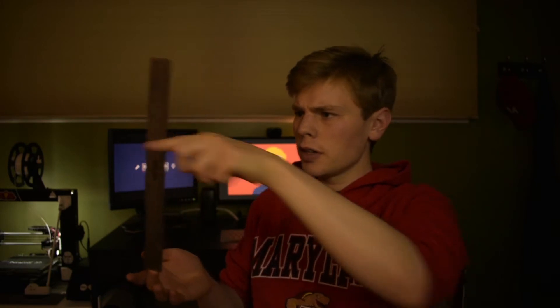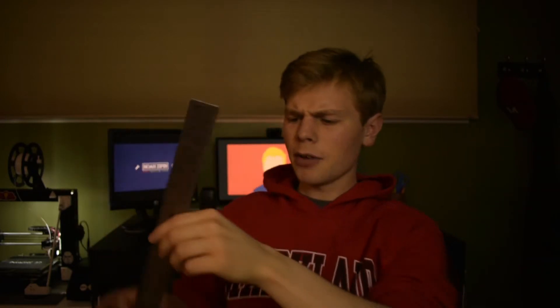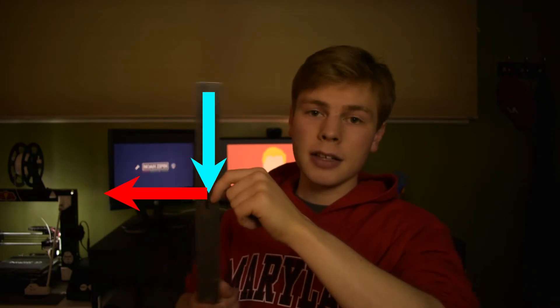What we're actually going to do is stabilize our self-balancing robot the same way we do with our finger and the ruler. When the ruler tilts in one direction, we accelerate our finger so that it sits right underneath the center of mass of the ruler, so there's no net torque and effectively the ruler stays upright. By accelerating the pivot point, we're changing the angular velocity of the center of mass of the pendulum, inducing an angular acceleration that creates a torque parallel to the pivot axis, counteracting the torque created by gravity.